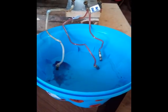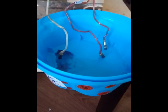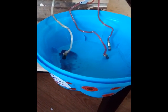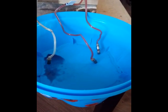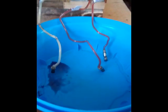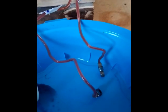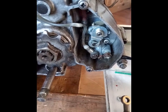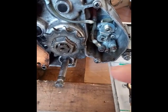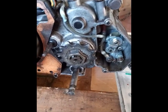This is a week later and as you can see, the old one did in fact drain out. I just moved it and it started to pour out almost instantly. The other two have been fine — I've given them a wee shake and nothing came out. That indicates the valves are working fine at the top of the banjos. The non-return valves are in perfect good order, so I'll replace them back onto the oil pump and remove the existing one with the epoxy repair.